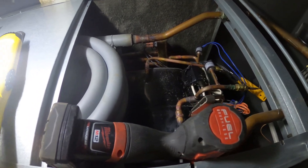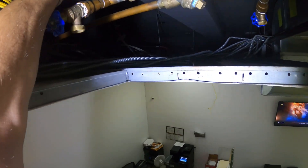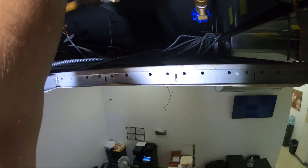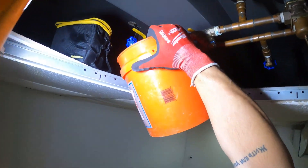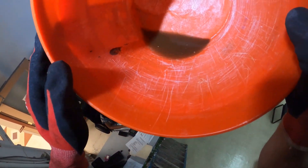They said it didn't work for months. All right, I'm going to close the supply and return. Close the two hand valves and we're going to drain from here and get to the strainer. I got a little bit of water coming out — that strainer's gotta be filthy. Look at that dirt just coming out of there.